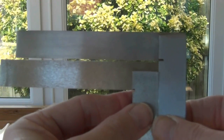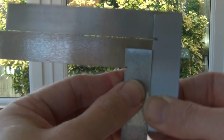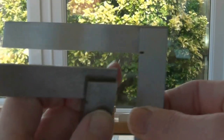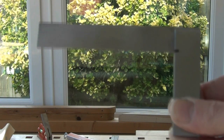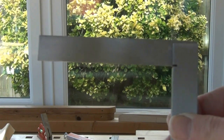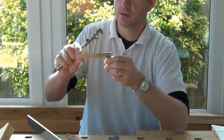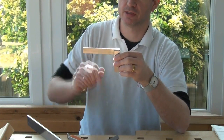Checking the inside — that's looking like there's an error on the corner on the inside. So I'll have to go and correct that, which will probably take about 10 minutes on some sandpaper. I've got a video that shows you exactly how to do that. I've also got a video that will show you another way of checking the accuracy. And it is slightly out of parallel — that would explain why I'm getting a good square on one side and the other side slightly out.